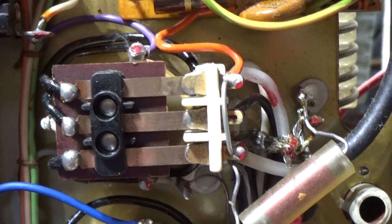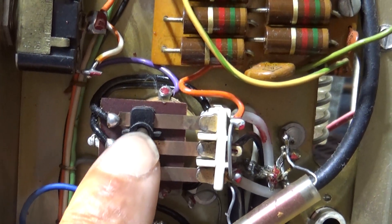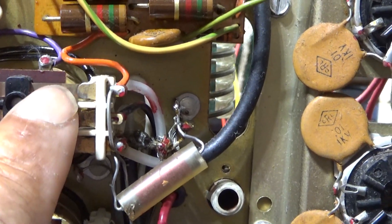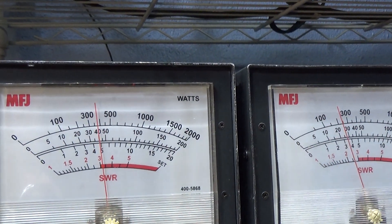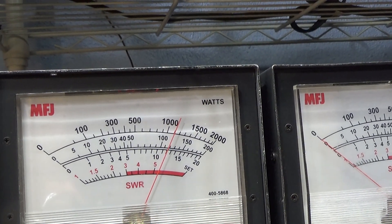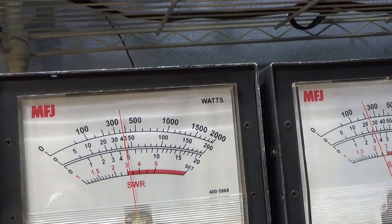What I'm doing to show you — this relay was sticking a little bit. I was cleaning it and playing with it, and this amp is off, caps are drained, it's unplugged and turned off. My watts were going in but they weren't going out. I cleaned the relay — this is the antenna relay — pushing it by my finger, and I finally got it to work. But when I push it in, this is on the input side of that radio, my watts jumped up. If watt meters are accurate, why is it jumping from 5 to 12 when I'm pushing in that relay?